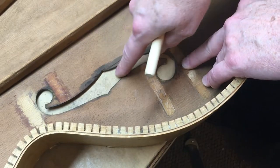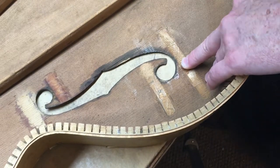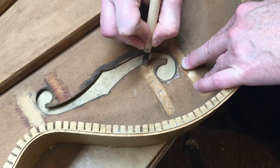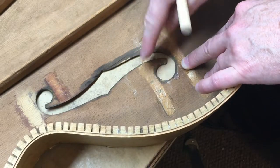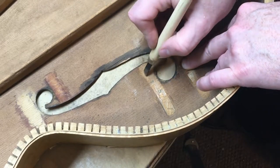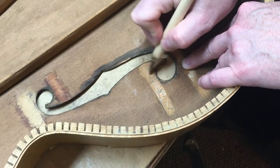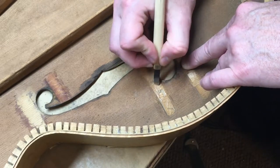I've got this carpet with foam padding flipped upside down so I don't have to worry about scratching the top of the guitar. When I'm scraping - and you're going to love this sound especially if you've got headphones in - I'm going at it at roughly a 45-degree angle. I am being careful around the f-hole, but I've got to get this old glue off here before I can re-glue the braces.